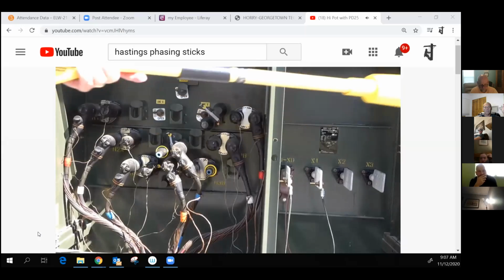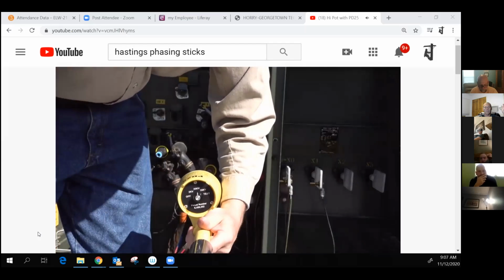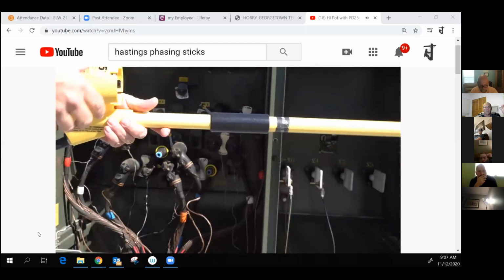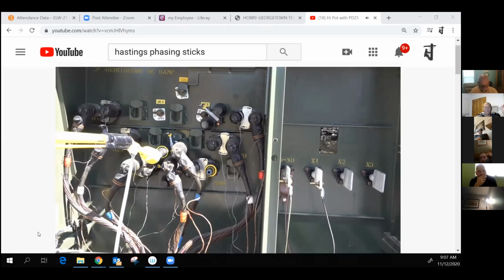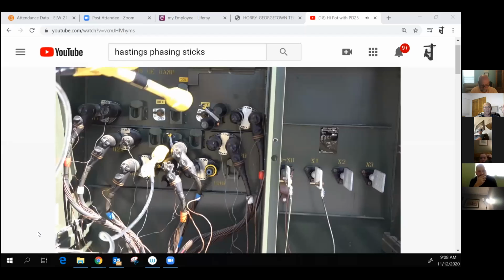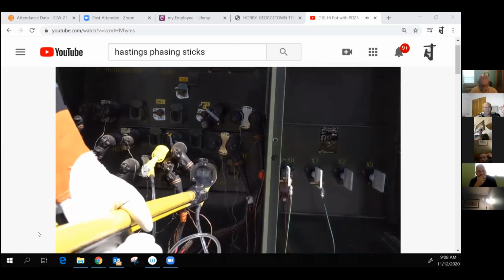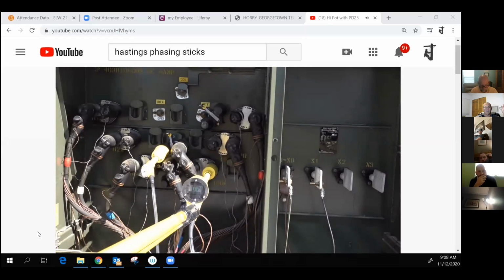After testing the meter and high pot, we need to make sure we put the meter in the correct switch position. Since this is a 13.8 kV phase to ground pad mount transformer, the meter is put in the 20 kV switch position. With the primary de-energized cable to be tested isolated and parked on the far end, and isolated and parked on a feed-through bushing on the near end, insert the probe without the high pot into the feed-through bushing. It is important to remember the probe without the high pot is connected to the de-energized cable, while the probe with the high pot is always connected to the energized source.